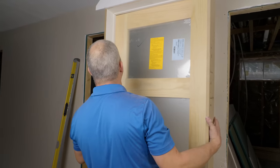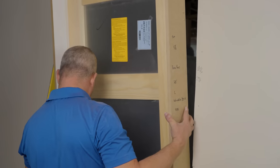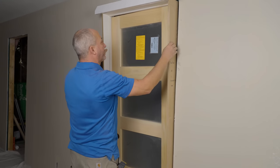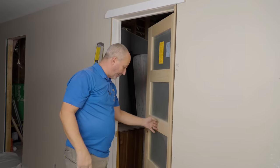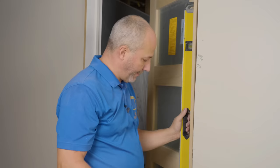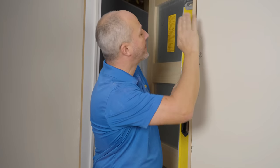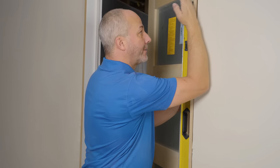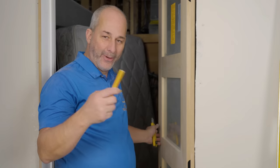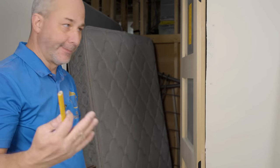Here's why — now I take my door, I'm setting it in position. All I have to worry about is making sure the front is flush and it holds it right where I want it. Nice and simple — one person installation. Remember we took a level to this earlier. We can do all the filler on one side. If the wall is level and it's not perfect, the top is in a little bit, so we're going to screw in the top and then shim to the bottom. One of the ways you know that it's leaning — watch the door: it wants to close all by itself. That's a good indicator.